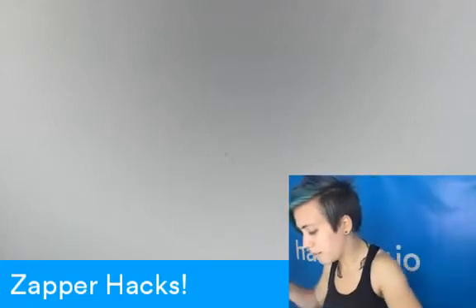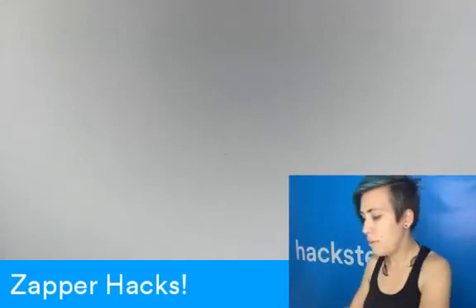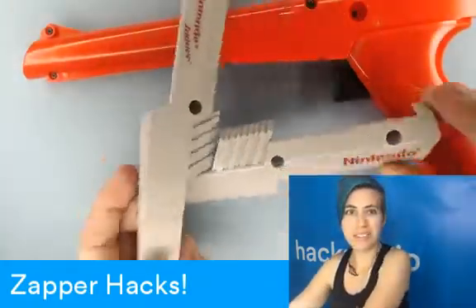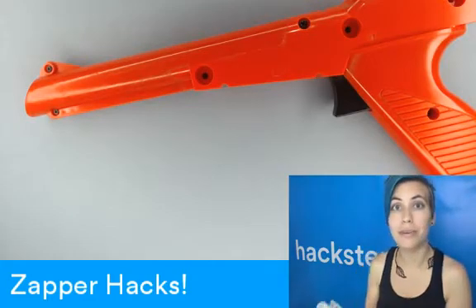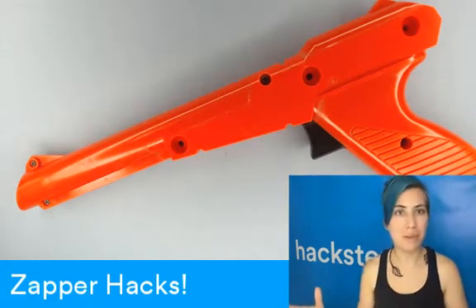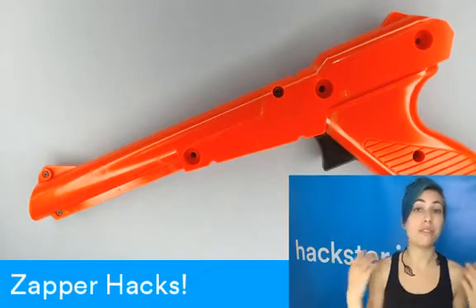This thing works in a really cool way. It doesn't shoot light itself — it's got a light sensor. You used to be able to fool these things by shooting them at a light bulb, and they would detect that as a target pixel, a bright target on the screen. In later versions they apparently changed that so you couldn't do that hack anymore. They would turn the whole screen black when you pulled the trigger, and then do another screen that was all black but with the target areas highlighted in light pixels, flashing at specific frequencies, so it could tell which target you were pointing at and you couldn't fool it by looking at a light bulb.